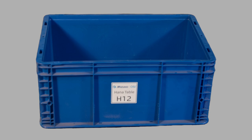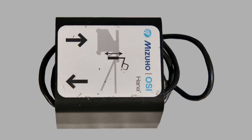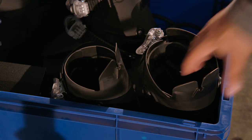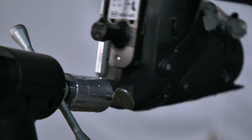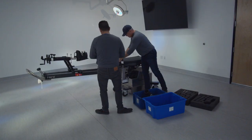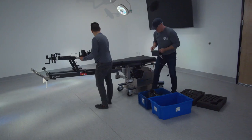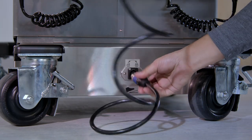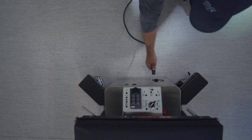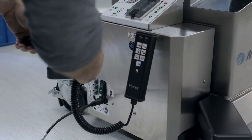In the smaller blue bin, the accessories should contain two large boots, two small boots, one foot pedal, one extension cord, and one femur emergency handle. Starting with the smaller blue bin, take the right and left traction boots, insert into the leg spar, and tighten the wing nuts. Take the foot pedal and place on top of the table, then uncoil the cord and plug it into the front of the table. Find the power cable and plug it into the wall, then plug the other end into the table.